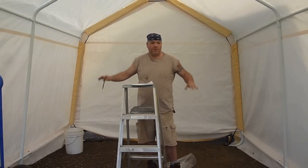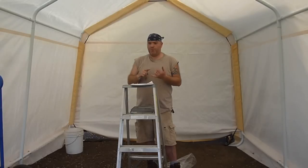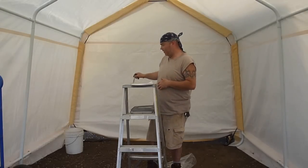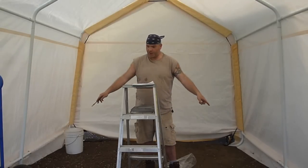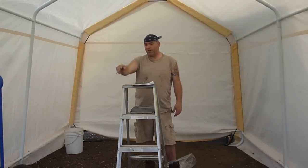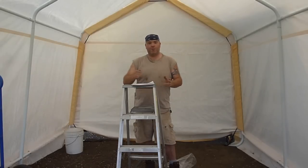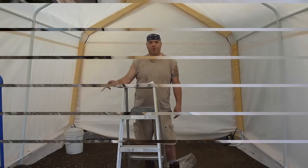Staking the corners — getting your own stakes, staking those down where the measurements are, where you want it to sit. I think that helped a lot, both in just keeping it from moving around as I was situating things. Once I staked it down I could move things around and I knew that corner was going to stay right where I wanted it. You might go around and actually put a stake in every single leg — I'm probably actually going to go back and do that. Washers — these bottom side bolts down here, they're the only bolts in the whole thing except for the ones where you put the bottom parts of the legs on. I wish I would have grabbed some washers. It didn't come with any washers and you definitely kind of scrape things up without them. So I wish I would have either gotten washers with the kit or went and got my own washers.